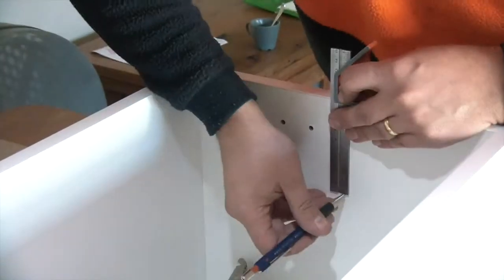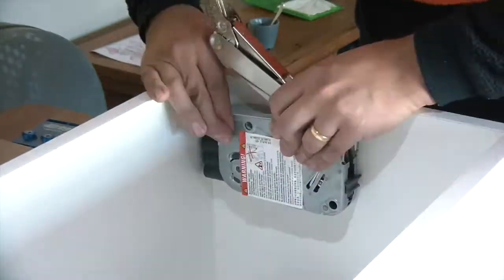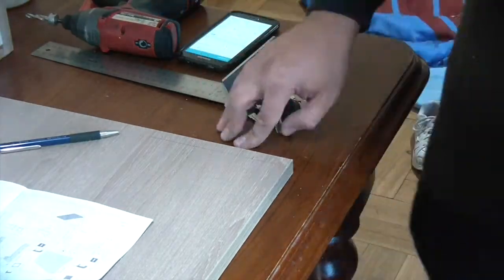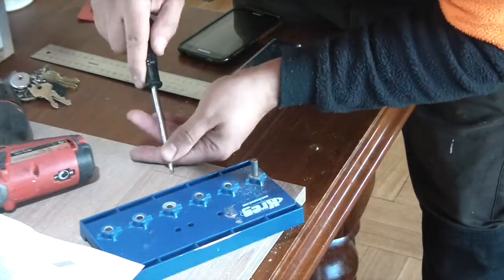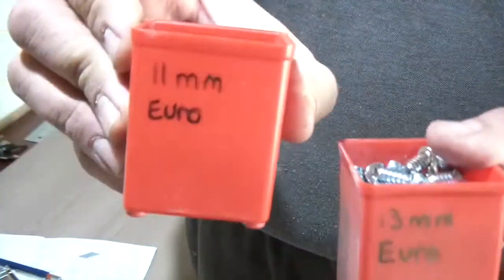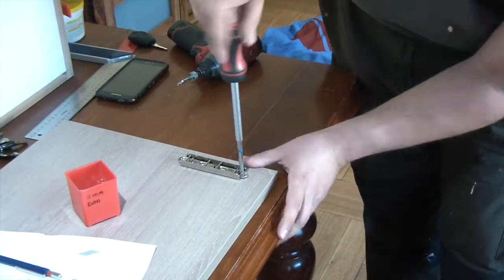Here I'm using my Kreg shelf pin jig with an auxiliary fence on it. Once you do that little mod, you've turned it into a System 32 drilling jig — basically all high-end European hardware is done in System 32. Watch how these guide pins just slip in and those built-in euro screws fit perfectly because it's all set up for System 32. Good tip. I'm also using it for fixing the hinge plates using 11mm euro screws — drilling the first hole using the guide pin, using the tool as a compass to set the second point. Euro screws are great where you've got a thin board and need a strong bond, because they engage the sidewall very strongly and don't need depth for strength.